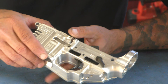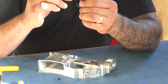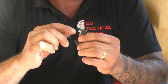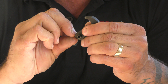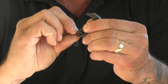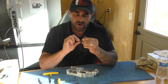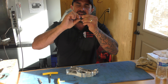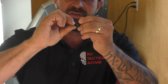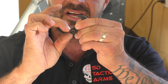Also, another thing I'd like to point out is that in a mil-spec trigger there's often still a lot of take-up. Your sear is going to ride on this flat spot here, and the longer it is, the more you're pulling that trigger across it to make it go off. You can take a file — as long as you file 90 degrees from this sear right here, file this way, and make this ledge shorter.